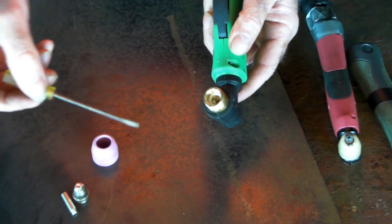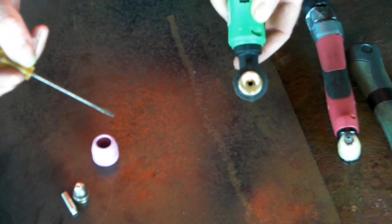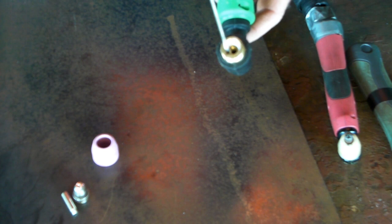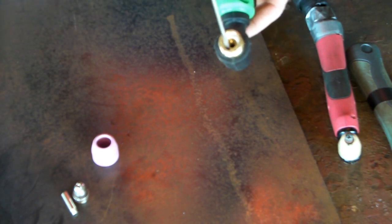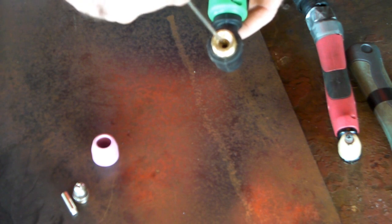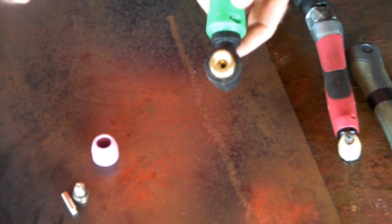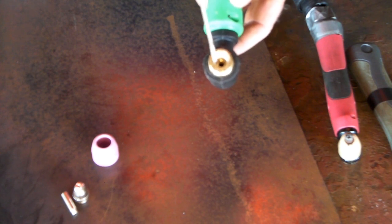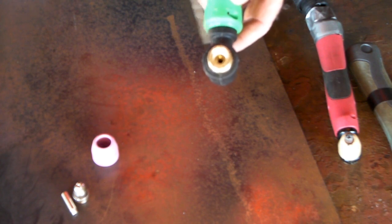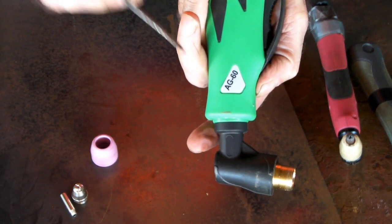These consumables are a little bit dearer than the PT31s - that's probably why they've got threads on them. But you've also got to watch with these torches: there's a ceramic ring built into the torch, and sometimes it gets brittle and cracks. If it cracks, it'll arc out between the center and the outside and won't give you a proper cut - it'll start spluttering. So when your CUT40 or CUT50 starts spluttering in the cut, it could be a hairline crack in that ceramic, because the arc will jump across it.